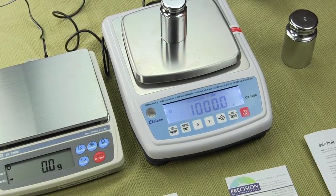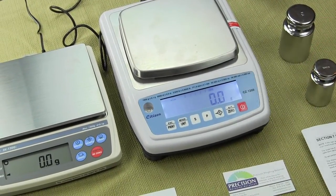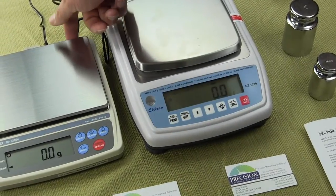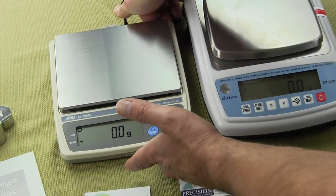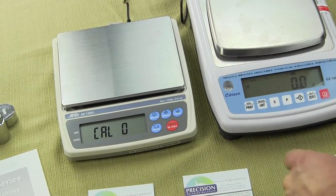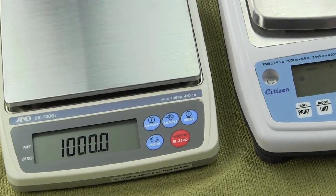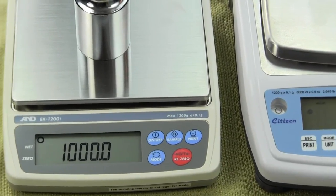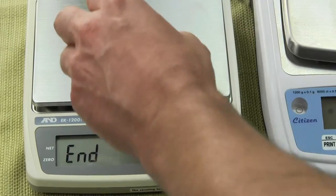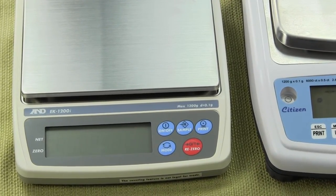That's really not the best way to design a scale. With the A&D, the calibration is different. To perform calibration on the A&D, go behind the scale and press the button in the rear. You'll see 'Cal 0' — simply press the print key. It stores the zero reference value. The scale calls for a 1000-gram weight, so you put 1000 grams on the platform, press the print key, the scale says 'end,' you remove the cal weight, press mode, and the scale returns to weight function. That's how simple the calibration is.